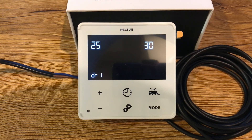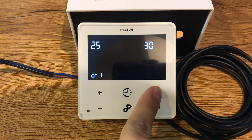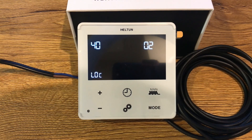Parameter number 25 is dry mode time — this specifies how long in minutes the thermostat will remain in heating mode when dry mode is selected. Parameter number 26 defines the mode to switch to after dry mode operation completes. Parameter number 34 is related to the child lock restriction level.